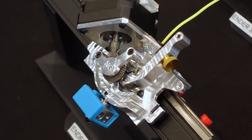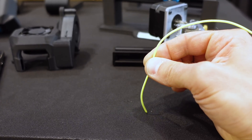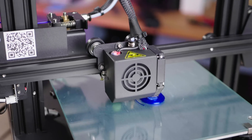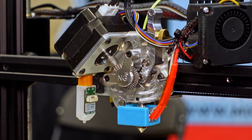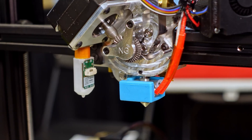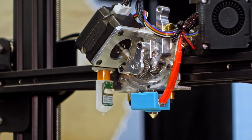And in that section, the filament is going to be under compression. Parts under compression like to buckle, and especially with softer and flexible filaments, your filament will too — rubbing against the sides of whatever is guiding it, leading to friction and worse control over filament flow. With the NG, Micro Swiss simply took that motor and swiveled it out of the way, making for a super open and accessible hotend, and what they're claiming is the industry's shortest filament path at under 41mm long. As a bonus, this is also getting the weight of the motor closer to the extruder's center axis.